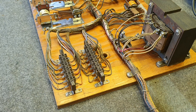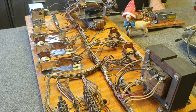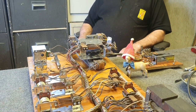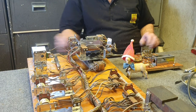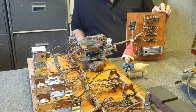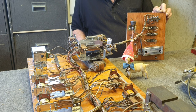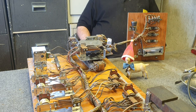We've clear coated the board itself, cleaned all the relays, cleaned the score motor, and we've done the actual tilt board. There it is with the fuses — and now the middle fuse, someone had soldered the wires together for some unknown reason, so we'll have to investigate that when we get it all back together. This is a project in the making — we won't finish this till next year. We're hoping to take it to our annual Pinfest, which is about the third week in September.